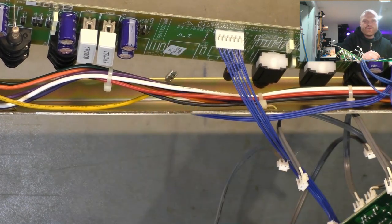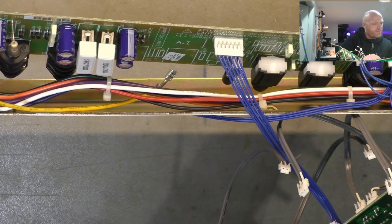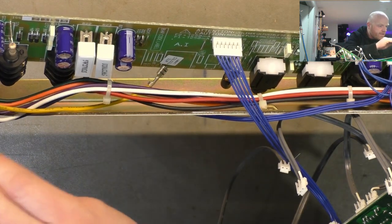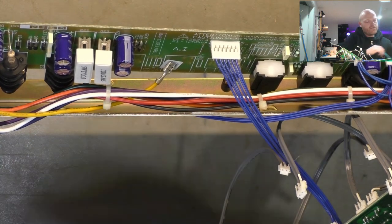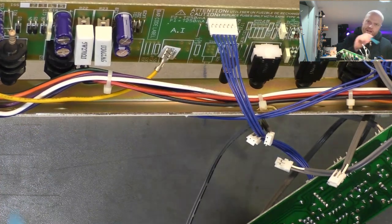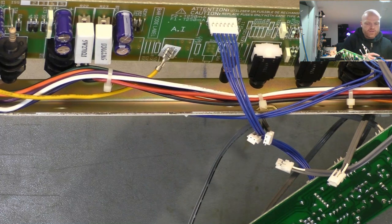I think they use the same board for the TSL, I believe. And it's just got some parts that aren't populated for the DSL. Looks like a DI section over to the left there. It's got an XLR blank spot. So yeah, there's the same layout of circuit board used for different models according to what's populated and what's not.